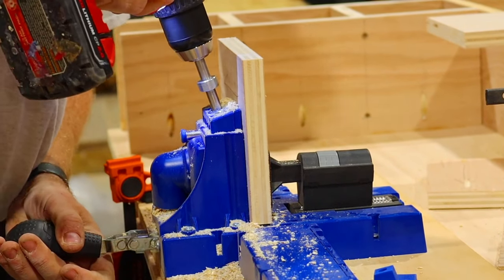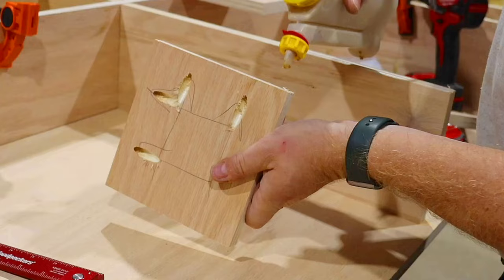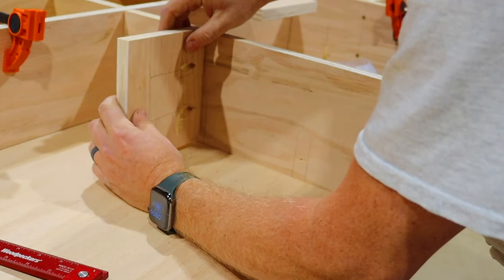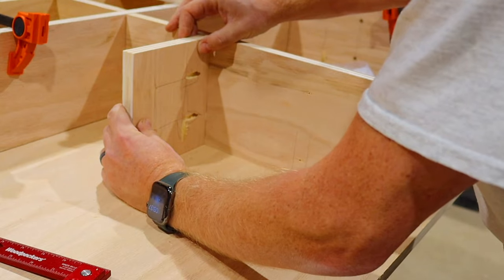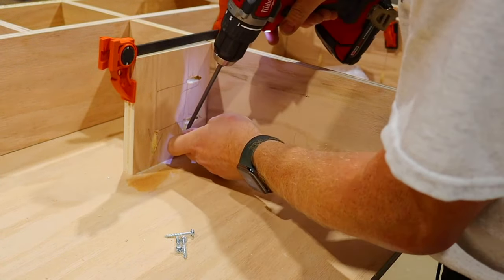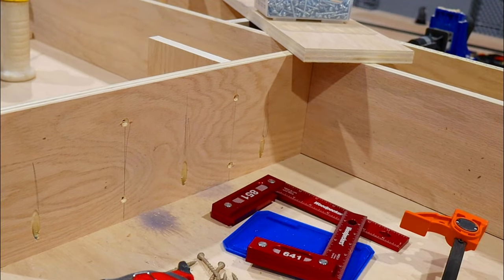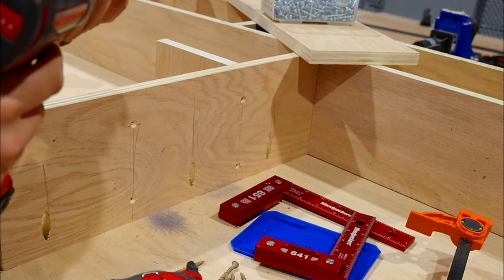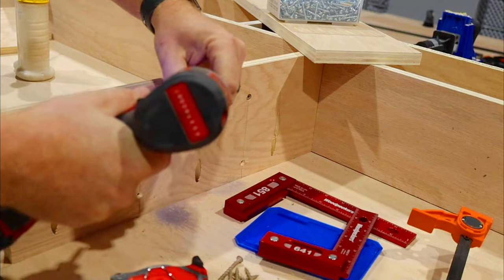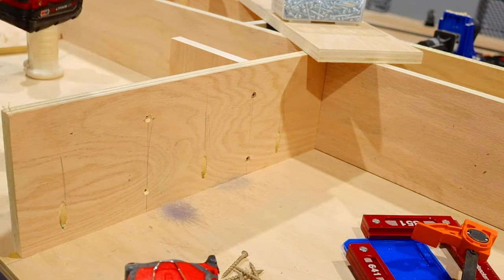With the dry fit done and the drawers actually cut, it was time to move on to pocket screws. I cut an awful lot of pocket screws — I lost count — but pocket screws were the right decision. The pocket screws hold the top to the grid structure from underneath; it makes no sense to drill holes in a perfectly flat surface. For the longer pieces of the grid, I spaced them about eight inches apart. Between the glue, the amount of pocket screws, and the screws coming through the bottom, this thing's already over-engineered. There was one exception where I used deck screws in areas where the pocket screws wouldn't reach — where I couldn't get a drill in. I pre-drilled holes with a countersink bit and used inch-and-a-half deck screws. Between the glue, the pocket screws, and those deck screws, this thing's bomb-proof.